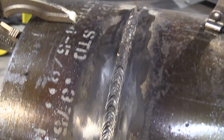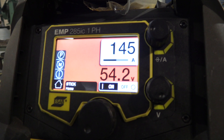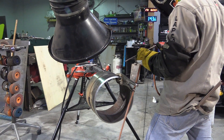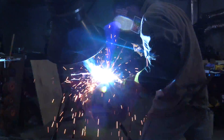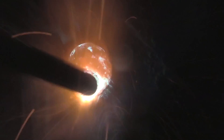After a quick wire wheel, ready for the cover pass — it's in pretty good shape, just a little bit sunken in, so putting a 1/16th height on the cap should be no problem. Going down to 145 amps for the cover pass. If you stick the rod, this is the way to avoid arc strikes: just unclamp the stinger and then pull the rod loose. You don't want arc strikes anywhere outside of the bevel, anywhere they're not going to be covered up with weld. It's a good habit to get into — instead of trying to pull the electrode loose, just undo the stinger, then pull the electrode loose.